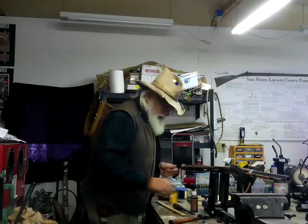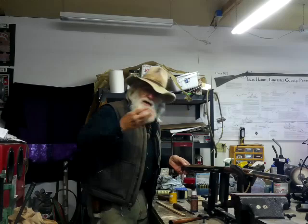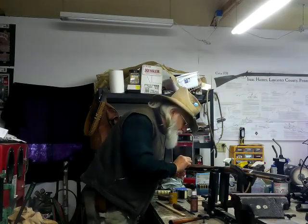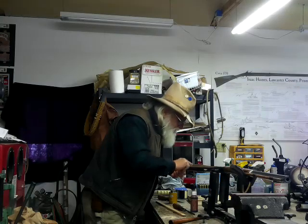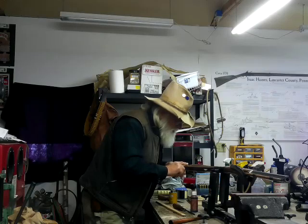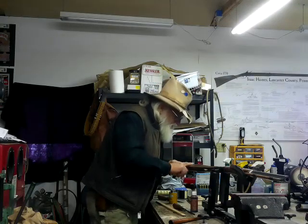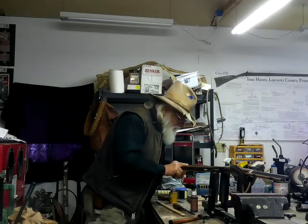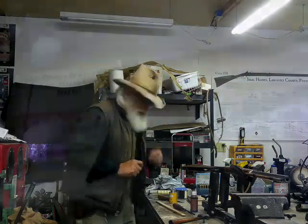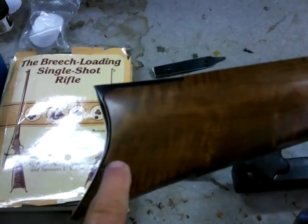So what I did is I got it and stuck it in there. Then I got a little bit of stain, stained it, and rubbed it out. What that did is it made those granules of sawdust collect and sink a little. So get a little bit more and rub it into that crack. What it's doing also is now it's sucking the stain out of the other bit of sawdust that I put in there and stained, and it's sucking it up into the new sawdust — it's actually coming back to almost exactly the same color as the stock around it. Let me get you in close so you can see — the crack is right above my fingertip.